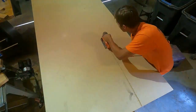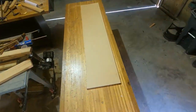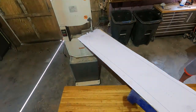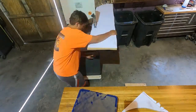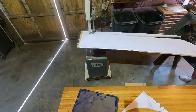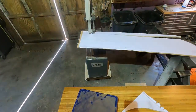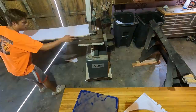In order to do it by hand, I got a 1-to-1 scale printed onto a piece of paper. I spray-glued it to the MDF and went ahead and cut it out with a bandsaw, just roughly, not very close to the line. And then I sanded it down to the line.